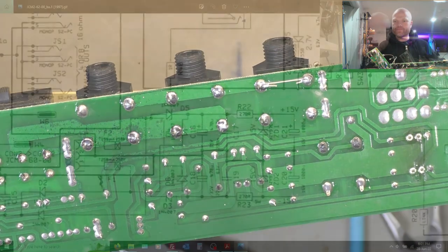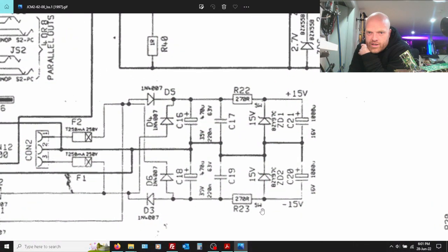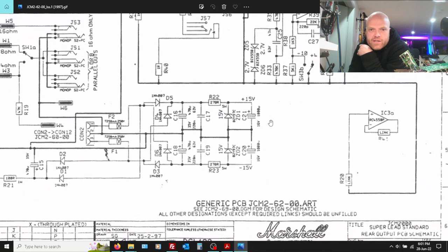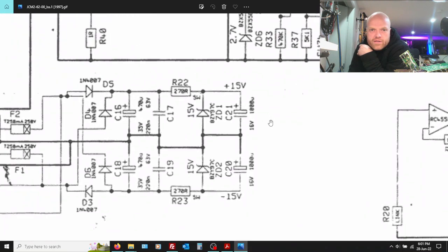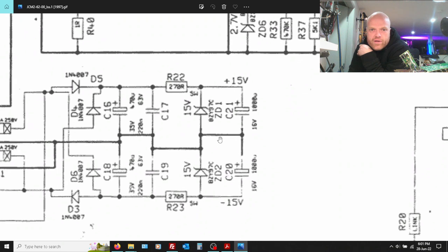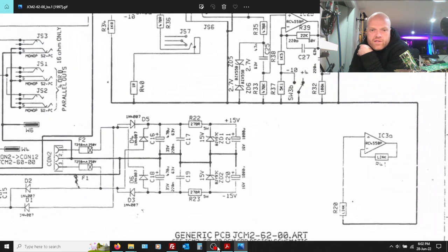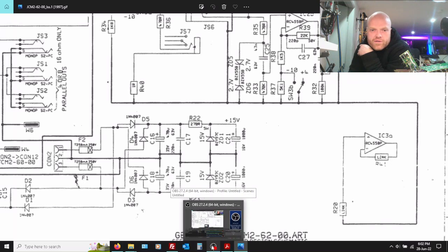Moving on. Right, so this schematic's a bit blurry, but you get the idea. It's 2 15-volt Zeners in the usual configuration with a dropper resistor to form a bottom basement budget regulated plus minus 15-volt supply with a lot of wasted energy turned into heat. So yay, that's our two diodes there, 15-volt BZY97C. So I'll just check the power rating on them just for fun.